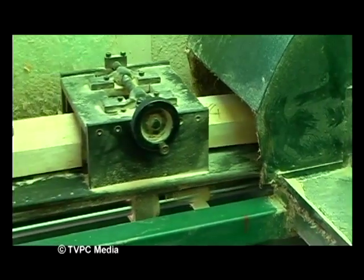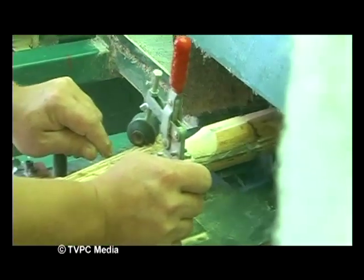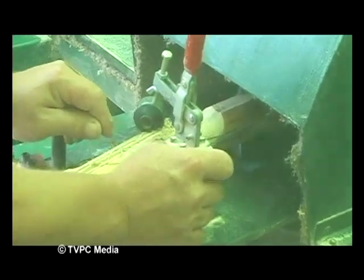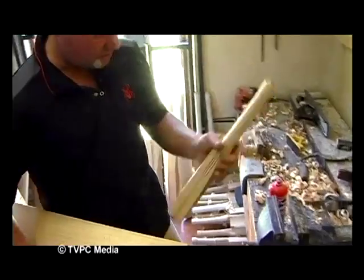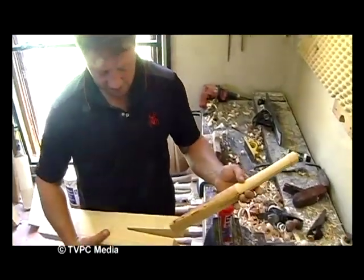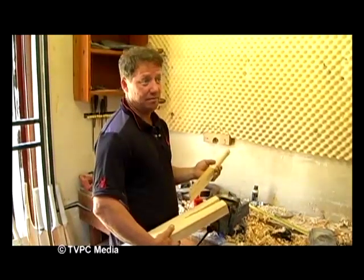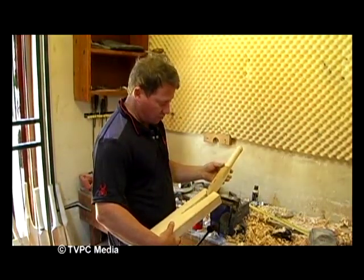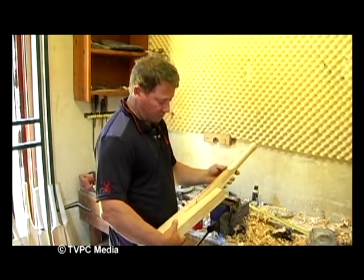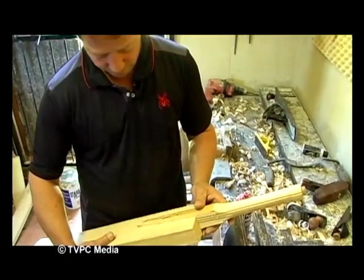First the cleft is inserted into a machine making a V-shaped cut at the top of the blade. Then a similar cut is made with the handle so that it will splice into the cleft for a perfect fit. What people must realize is the fit of the spliced handle into the cleft should be so tight that you could actually play a game with the bat before the handle popped out. Guys without great tools often have to start putting poly filler in or extra little pieces, which is something to avoid — this is a very crucial part of getting the bat together.